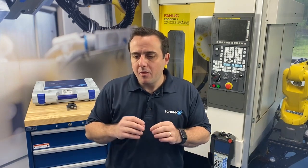The third technique that comes to mind is to simply use the vice you have, and that's perfectly okay — maybe you just need to get this part done and figure out a way to make it. But there are many disadvantages of using a vice that's oversized for the workpiece, especially in multi-axis applications, because you start losing accessibility to the workpiece.